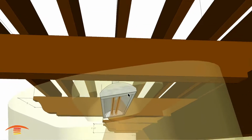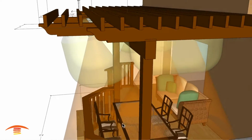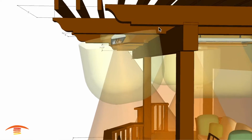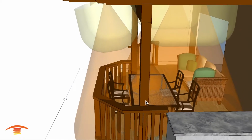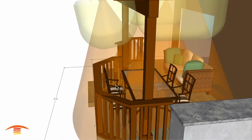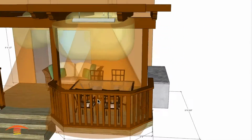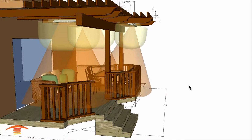All right, and with that 10-degree tilt, you can see that we got a good coverage over here coming into the seating area. Now, if that is an issue with this penetration right here, then if you point the heater straight down, you still will get the heat in the area that you wanted to. It would just throw out a little bit of extra heat down here, so that's not a problem going straight as well and still meeting all the clearances to combustible.